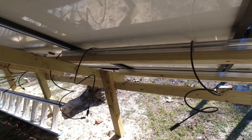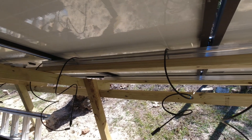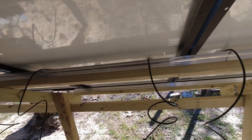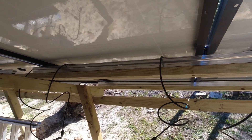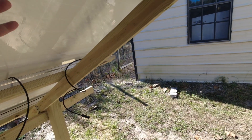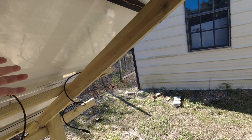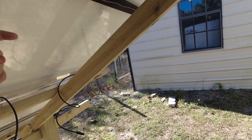These are roughly 40 volts at 10 amps. In series, your amps stay the same — you don't want amps too high going into the inverter — but your volts add up: 40 volts times 7 panels is roughly 280 volts. Same for the second string. Then once we put them in parallel, it's the opposite: amps will double but volts stay the same. So we'll still have about 280 volts but now 20 amps instead of 10.